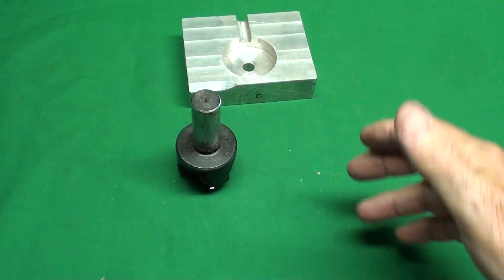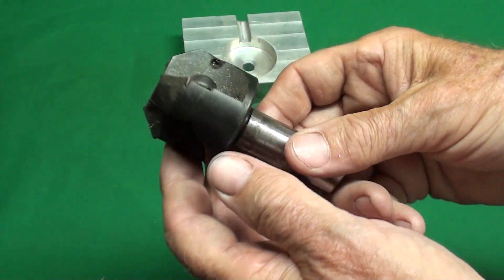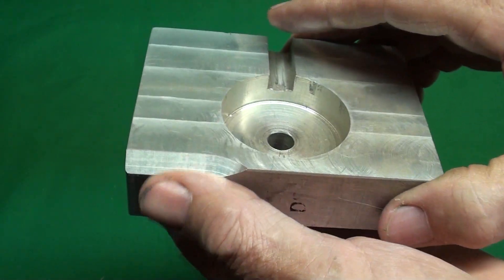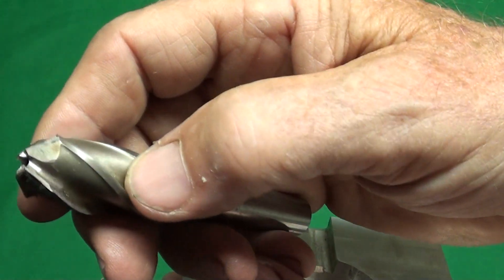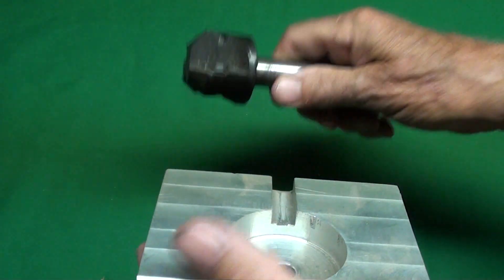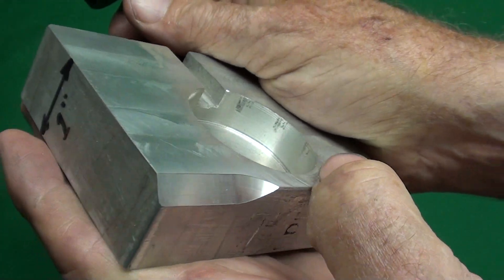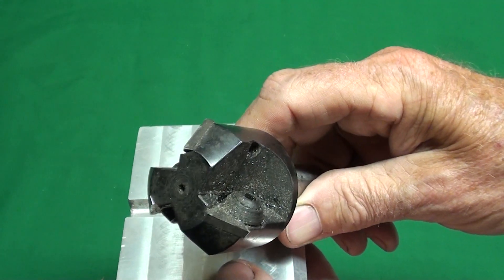Just 30 minutes ago, before I started making this video, I received a package in the U.S. mail — in good condition, believe it or not — and it came from my brother Jan in Cody, Wyoming. The last time he was here to visit, we had discussed how to make a bevel on the milling machine without tilting the head. It's very easy to tilt the head, but we do not like tilting the head if we can get away with it, because you have to tram it back in and that's a chore. So I had been using this bit for 45 degree bevels, but I can't get a very wide one. Then here in the mail he sent me this carbide cutter with three inserts in it. I took a sample cut and it just cut like butter and made a beautiful bevel. Thank you, Jan — and that's an idea for some of you, although this is used and I'm sure it costs plenty to buy new.